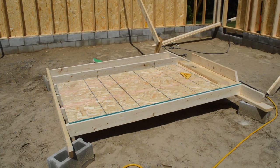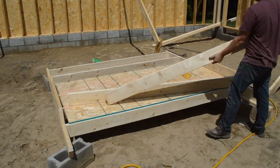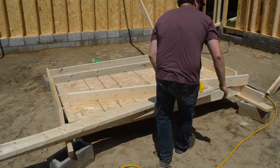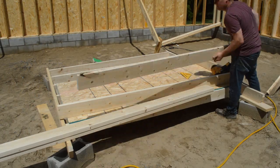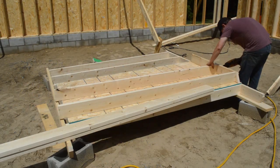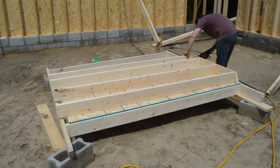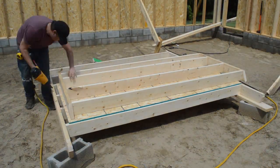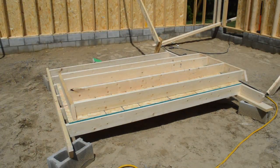I lucked out with this one — this wall is all framed, but I got a smaller one to do. Now that I got a surface to work on, I'm going to frame it on top of this one. It's another short wall that goes from the addition to the house. That way I got a level surface to work on. Super quick — top plate and bottom plate are all marked out. Just pop a couple air nails in there, double check square, put a piece of sheathing on it, and I'm good to go.